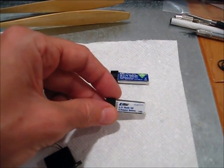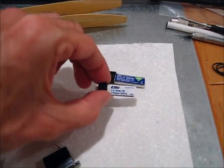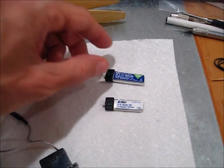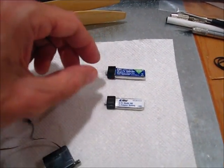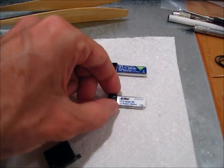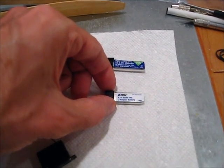Here's the one I've been using lately — this is 70 milliamps. It's a little bit smaller and more compact. The nice part about this is it only weighs 2.6 grams. When you fully charge the LiPos they're up to about 4.2 volts, and after a full day of flying with altimeters and everything else, this still had a charge of about 4 volts.